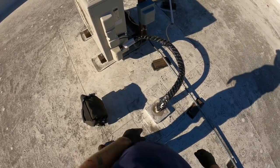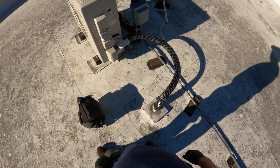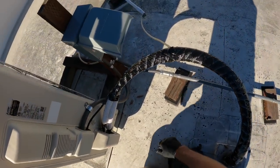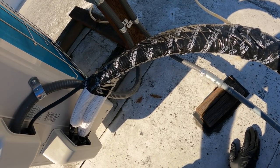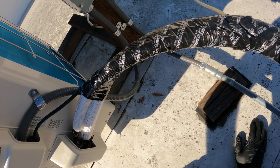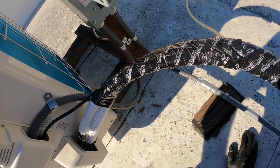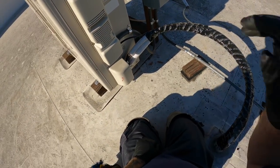The Siemens disconnect is pretty cool. Fuse disconnect with GFI switch built in for service. I like that. That was really nice. You don't see those a lot around here, but that is a nice little setup. Look at that. So you've got to run your 240 up and then a 110 circuit, and you've got a GFCI. Not bad. Not bad. Not bad.